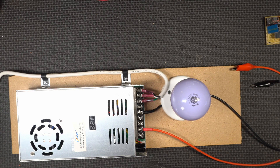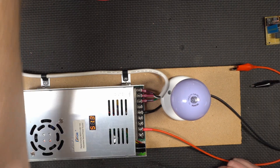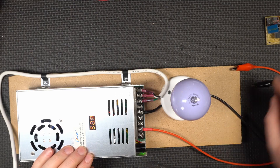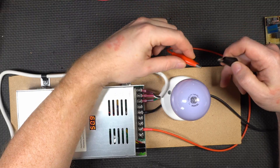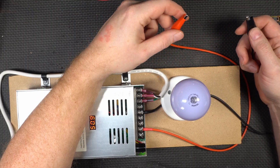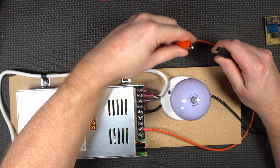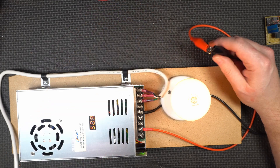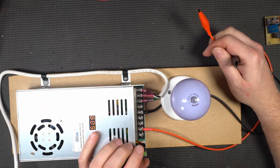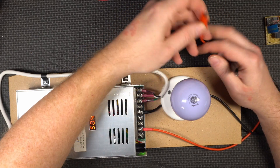All right, let's plug this thing in and see if I'm lying to you. Set to 51.3 volts. Now, normally if there was no light bulb here in series and I shorted these two alligator clips, the power supply would go poof. Because we have a light bulb, that does not happen — the light bulb lights up. I did measure the meter on the supply and it's actually pretty accurate, within a tenth of a volt of my actual meter.